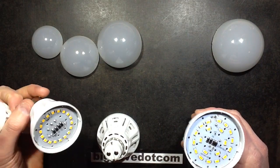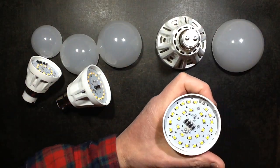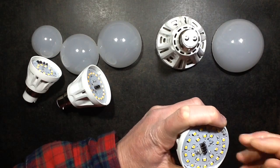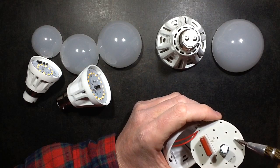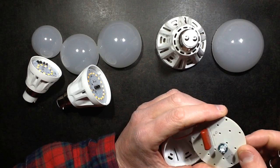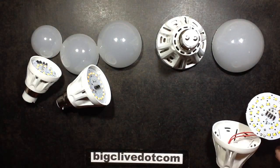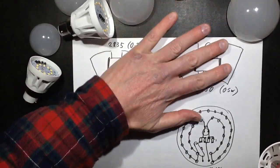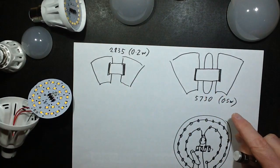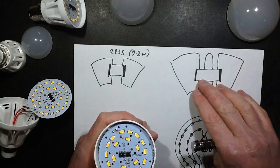They all share a very similar structure. I'll demonstrate on this one since it's my favourite. The printed circuit boards are just clipped in and they come out like this. They're not aluminium substrate; however, they are this white substrate. I'm not sure if it's just standard or if it has a high ceramic content. There's no aluminium core, but where the pads are, they have an arrangement where the small LEDs have quite large segments, and with the larger LEDs they also have large segments to help dissipate heat — the solder pads and track area that the LEDs are soldered onto.